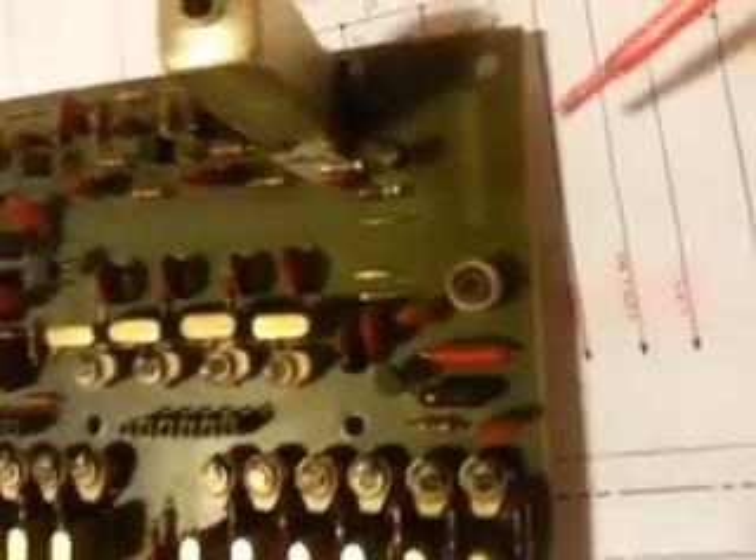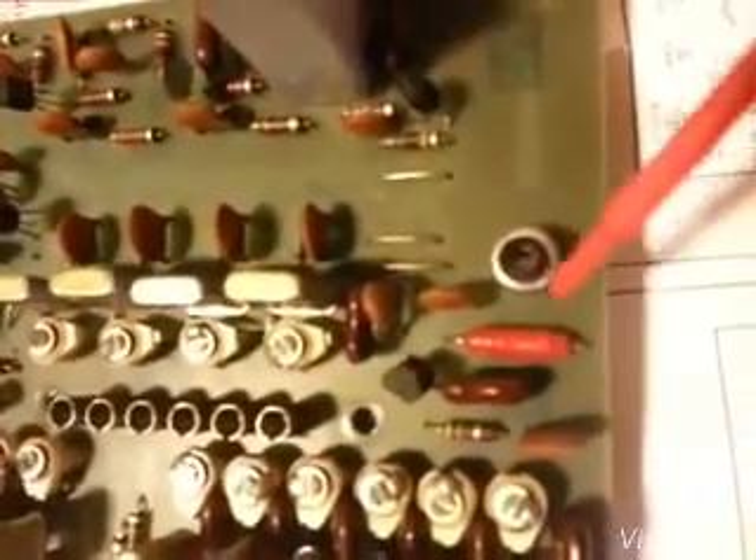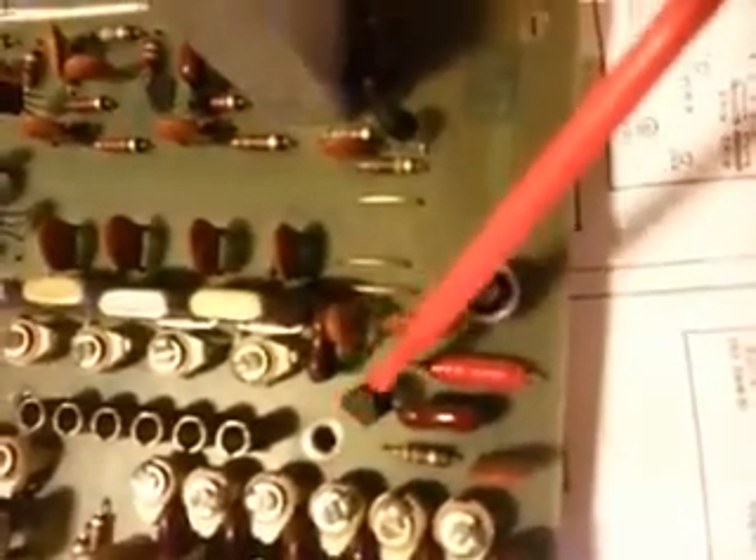Notice this good board over here. See these two transistors? Well, they're MOSFETs. See this one — flat side facing that direction. More importantly, this one right here — see the flat side facing this RCA jack. Now go over to this circuit board: flat side facing away, flat side facing away. And here — RCA jack, flat side facing away. But on the good board, RCA jack flat side is facing the RCA jack.